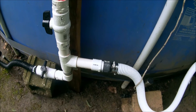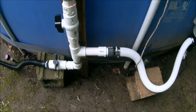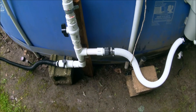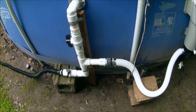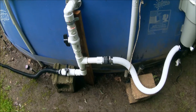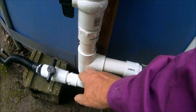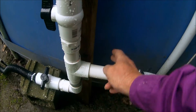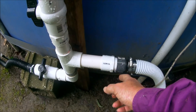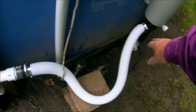To get all these things to work properly, you're going to need just some standard 1¼-inch PVC pipe — this is Schedule 40. You can buy a 2-foot section for $4 or $5, but I went ahead and bought a 10-foot piece. When I got ready to join my T to these little fittings, I just cut a 4-inch section of that pipe off, glued it in there, so I could have a threaded end on this particular coupling. And that goes to the pump.